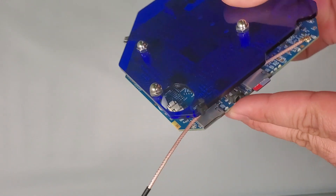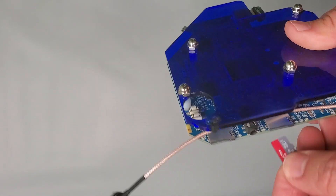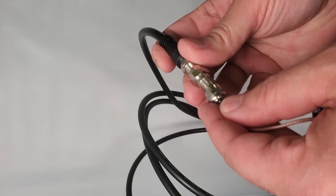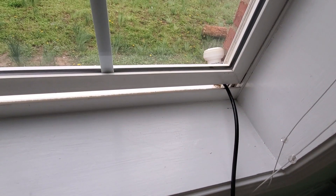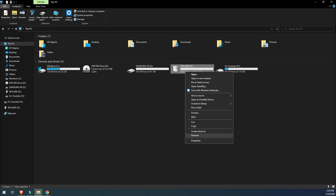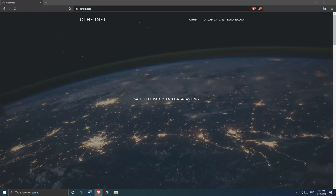Here in the corner you see the SD card slot for content storage. The second slot is for the system or the distro you will be using, whether it be Skylark or Armbian. Other components you may find in your package are the coax coupler and the LNB. I have not mounted mine on a fixed location yet, but it acquires signal and gets a light lock within a few seconds. For my setup I am using a 32 gigabyte SD card, but any high quality SD card larger than 4 gigabytes should work. Go ahead and insert your formatted SD card into your PC and head over to the Othernet web page and download the Skylark image.